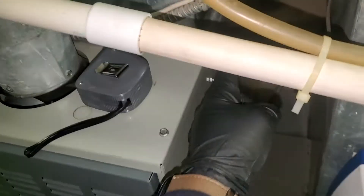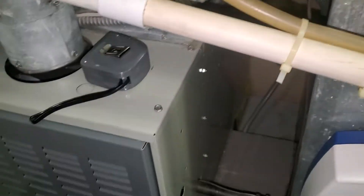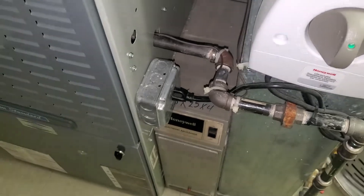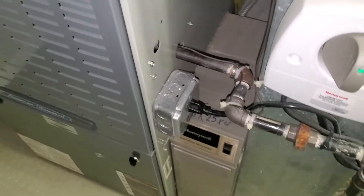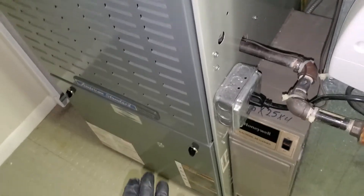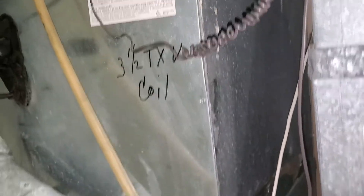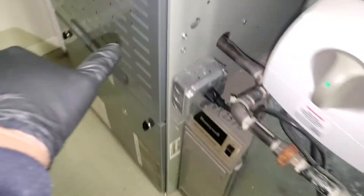Mac pack — we're going to update the Mac pack. The unit is 28 inches in depth, 21 inches width. Once we take the Mac pack out, we should be able to shimmy it a little bit over. We're going to have to put this on at least a 4-inch bottom box for sure as well, but we do have the room. The unit is 21 inches.